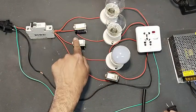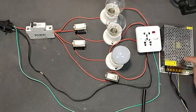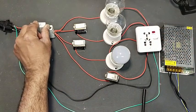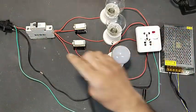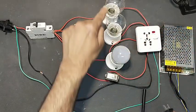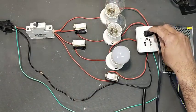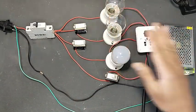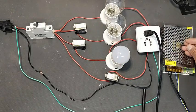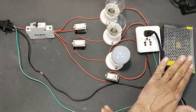First I will turn off the switches one, two, three, and the bypass switch. I am now testing this power supply — the circuit breaker is on so the system is now applying power. We can see the first lamp lit up, indicating the power supply is turned on and the capacitor was charged. Right now it is working within limit.